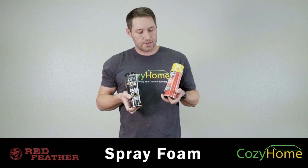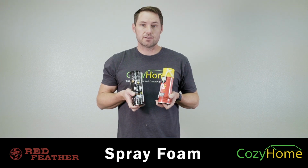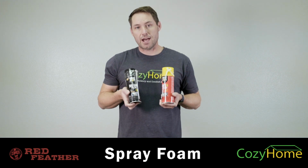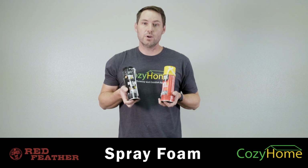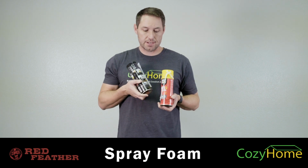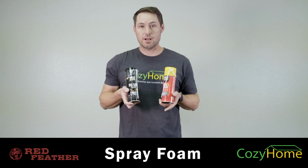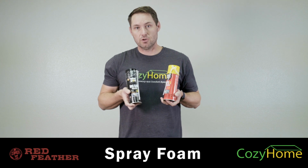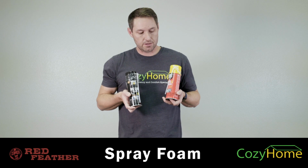These are expanding foam, so when you apply them, they're going to expand to, you know, much greater than the volume at which you install them at. So you want to make sure you account for that expansion. They also make a special one for windows and doors that is lower expanding. If you put this stuff around windows or doors, sometimes it can bend the frame of the door or window in and make it hard to operate the window. It can get bound up as you open and close that window or door. So you want to make sure you have the right product for the right application for it.